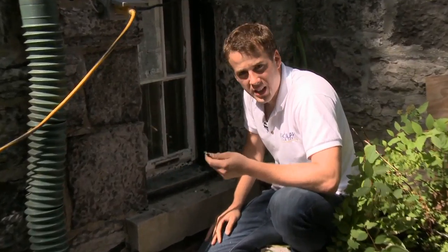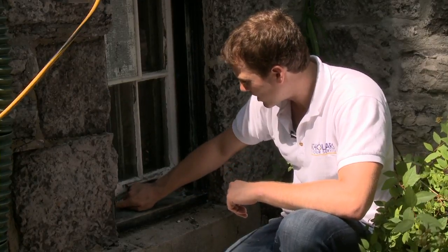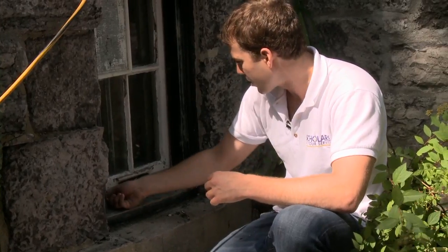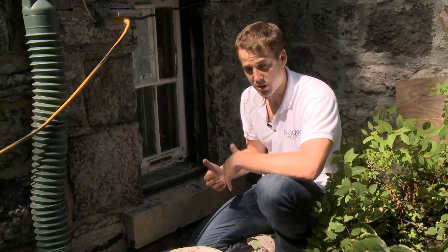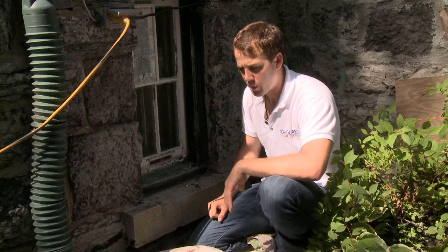Here's a good example of a lesson about over-prepping. This chip was connected to a piece of caulking and as I started peeling it away, I saw this giant, really old seal almost peeling all the way in. It was very tough to pull out and I almost ended up taking out this entire seal even though the rest of it's pretty well fastened. You don't want to over-prep the window. If I peel that out, I'm creating a lot more prep work for myself. So instead, I'm just going to cut it at the point that is loose — not peel everything out, not remove all the old caulking or old putty, only the stuff that's loose and already failing. Be careful not to make gouges in the wood from scraping, and always keep your wits about you.